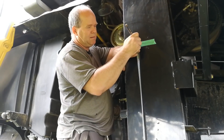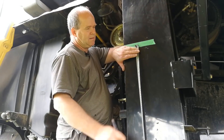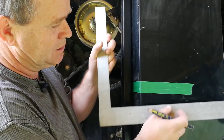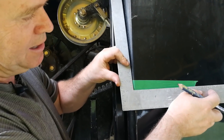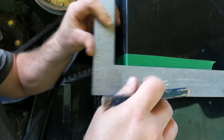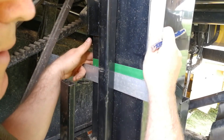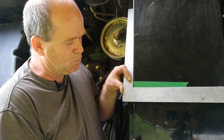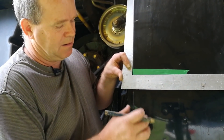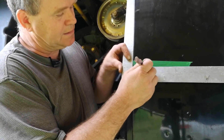Here I'm marking my 62 inches up from the bottom of the bearing. Using masking tape, once you have your height from the center bearing marked, you can simply use a square to transpose that height around to the end, across the back, and then around to the back side. For most harvesters, you want to place the sensor in the center of the column from the back of the clean grain elevator. On this harvester it's 1.75 inches.